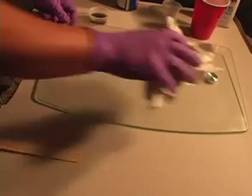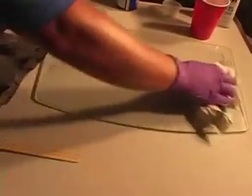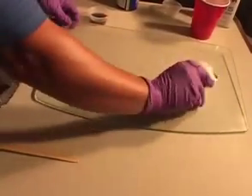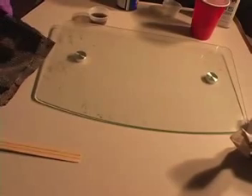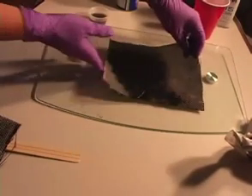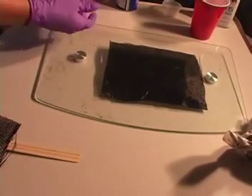Begin by laying out your tools and materials, including a clean sheet of glass at least 4 inches larger than the largest piece of graphite mat you'll be using. Normally I would apply mold release to the glass, but in this how-to I will simply give it a light coating of WD-40, which is more available to the average do-it-yourselfer. Double-check that the glass is large enough for your piece and that the carbon fiber is free from any debris.